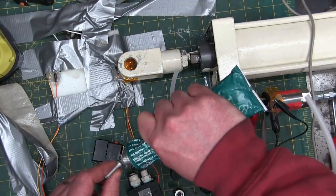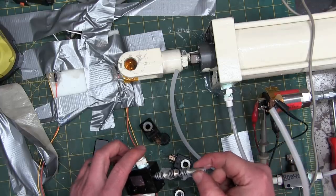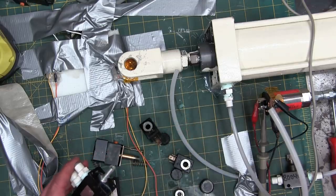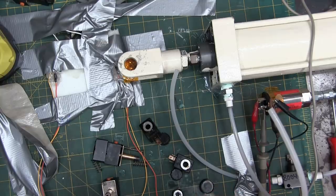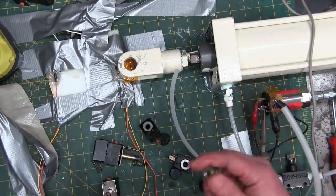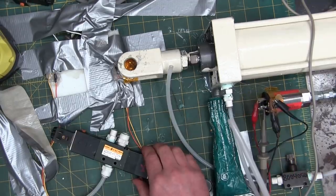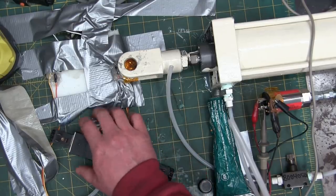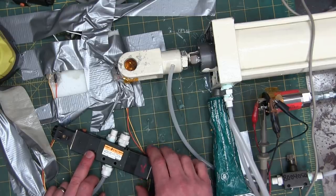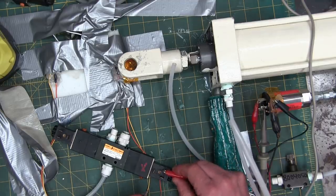Okay, we're going to put on the proper seals. Here. $800 worth of this stuff. And the trick is, of course, big gob of lube and just kind of ease it in. Make it a gob to better the job. And then we'll do the same on these guys. There's a single lip seal and then what looks almost like a bearing or a wear ring, depending on what part of the country you're from. Get that on there. Why was that not sealing? I'm going to jam some more on the seat. Okay, give her another try here. Oh, for fuck's sake. That one's still working. So this side's still messed up, for whatever reason. Something wrong. Well, X marks the spot. I'll give her a try here. Pay peanuts, you get monkeys.